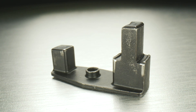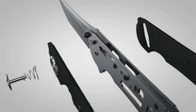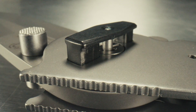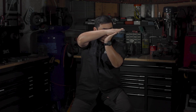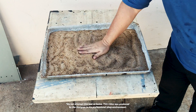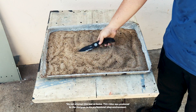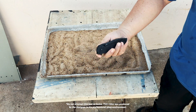So now that bolt has two lugs — one for the adjustment, the other for the strength. This first and bigger bolt here goes from one liner through the blade and anchors in the other liner. So it's not only strong, but the contact between the blade, the lock, and the liners has no angle, so the chance of something slipping is much smaller. From all the tests I have made, it never fails, so you can trust that the mechanism is tight and prevents stuff from getting in. That makes this a very reliable lock.